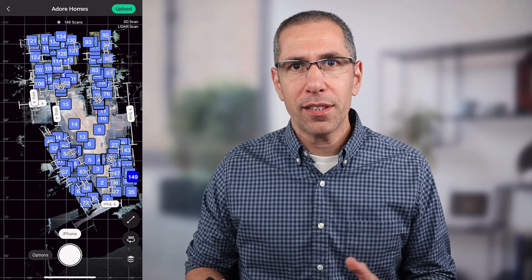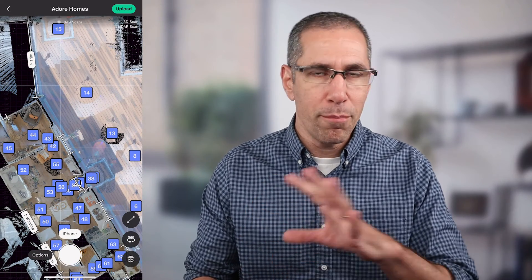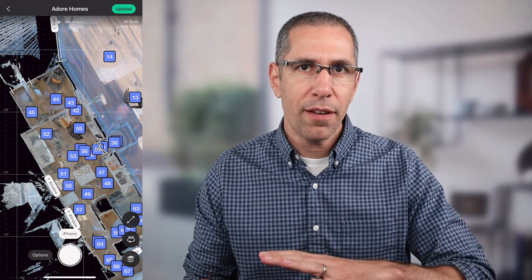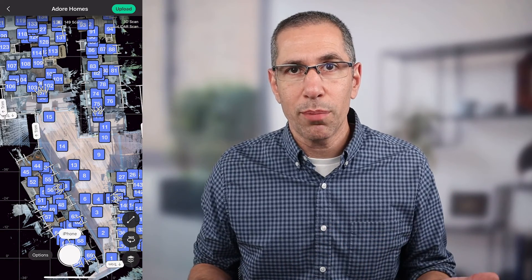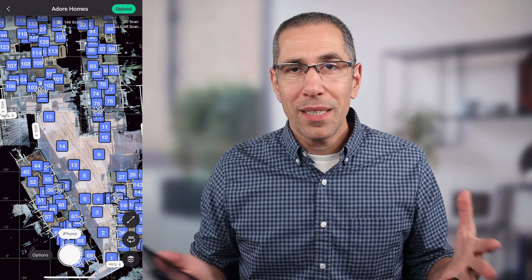Back at the office, I can look at the model. Make sure all the markings you may have missed on site get added before you upload the data — mirror markings should have been done on site, but you may have some window and trim markings to take care of now. Once all your markings are set up, just press upload and you're done. The alignment between all scan positions has already been done, and the processing engine will refine it further. Creating your digital twin is entirely automated from this point. Scanning is really just a matter of understanding what you're going to do with the digital twin after processing to know where to place those scan positions for the optimal outcome.